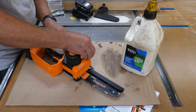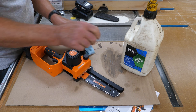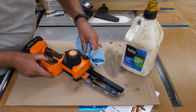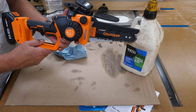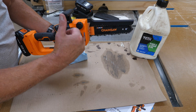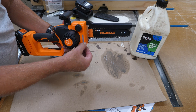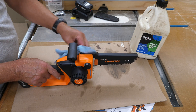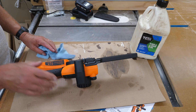Not too bad. Once you get up to where it's kind of full, it fills up really fast — that neck is small in there, so keep that in mind. I can put my cap back on and my little keeper back down in there. There's a gauge on the side — you can see right here — there's a gauge that lets you know how much oil is in there. Right now it's full. It has a minimum mark, so when it gets down to that minimum mark you're going to want to refill your oil. Now, while things are charging here, I'll show you how to adjust the chain.